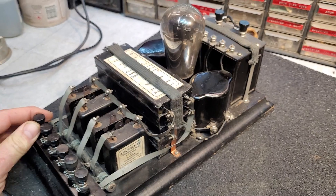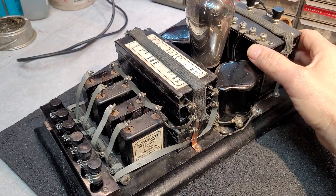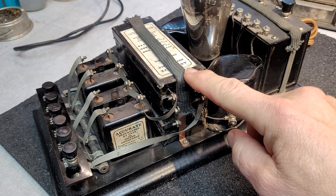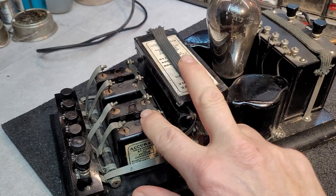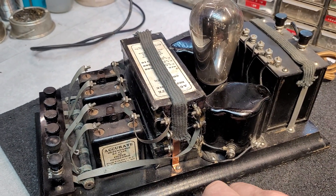So it is a clean, well-designed power supply as far as layout goes — it really is a nice unit. On a side note, I did go through and restuffed all these caps here as well as the bypass caps, because they are all exposed and I felt that needed to be done.